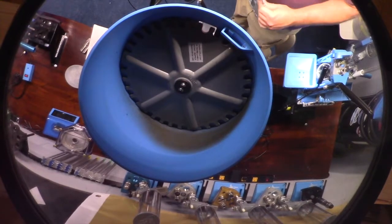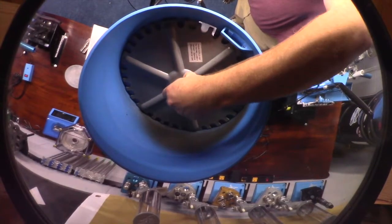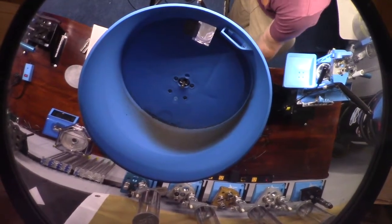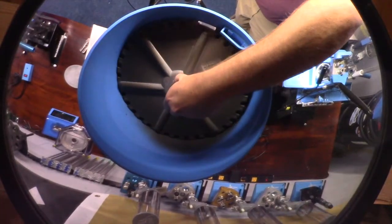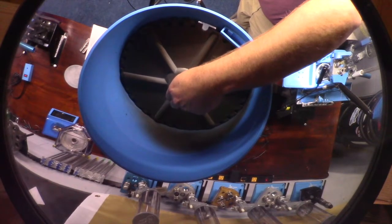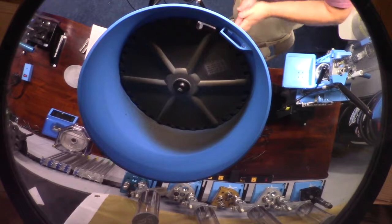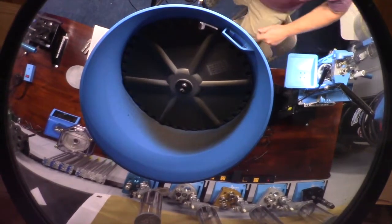Alright, the next thing we need to change is our case feeder plate. Right now this is the large pistol plate that's installed. Just going to reach up and remove that, pull out the large pistol, set this aside, and we're going to put in the small pistol plate in its spot. Again, there's a center pin there, and we're just going to rotate it until we feel it fall into place into the slot on the case feeder. Well, that's pretty dirty. I think that's due for a cleaning. But that's all it takes on the case feeder.